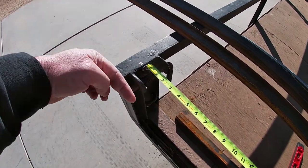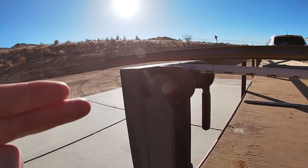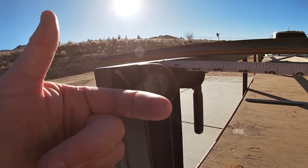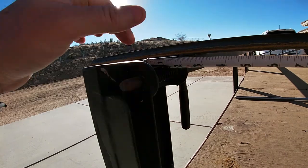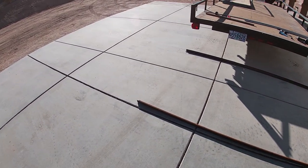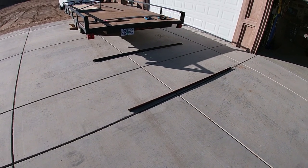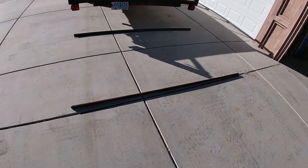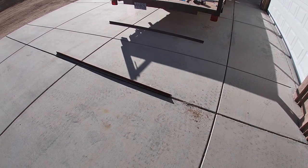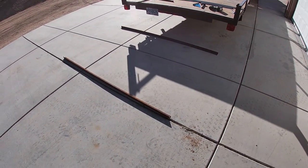So I don't need to make it outside to outside. This gate has some weird funky thing where a piece of plywood went in and then this piece went through the plywood, but there's never been an actual gate. As long as I have an area for the piece of metal to go in and the pin to come through — I'll cut this pin out and maybe use it for a hinge. The ramp gate width is 93 and a quarter inches inside to inside, so I went with 92 to give a little over a half inch on both sides.